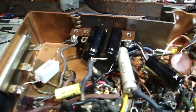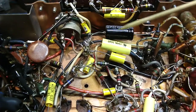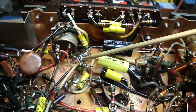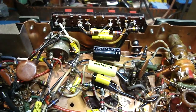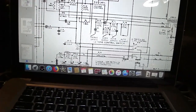If you look over here to the side, I installed this terminal strip today, and I took all the capacitors except for this one here, which is usually a 12 microfarad at 160 volt cap — this one really doesn't matter — and the ground for this electrolytic capacitor was connected about here. All the other four capacitors were also tied here. When they were trying to get the radio to work, they would turn it on and hear hum. So even with brand new capacitors, we still had hum. Why? I have the schematic on my laptop, but I've done so many of these radios I know it pretty well by heart.